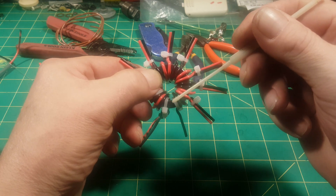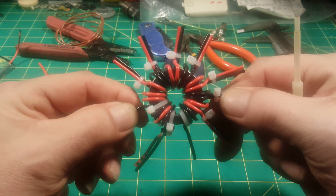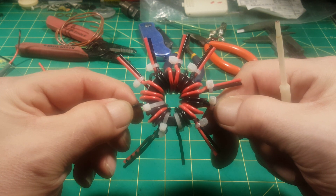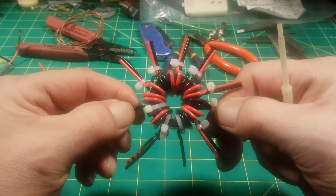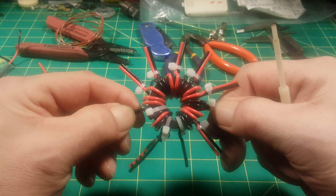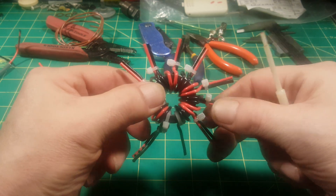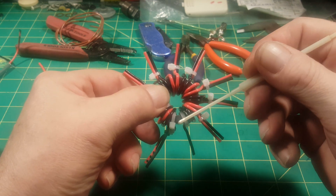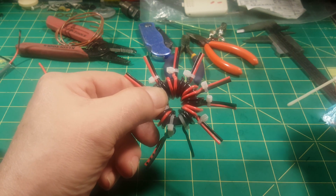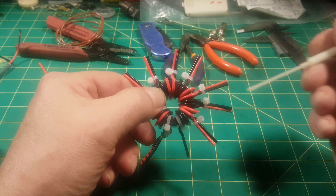You can see a gap there between the high-ratio 81-to-1 tap and the ground bundle — that's a fair gap, about an eighth of an inch. That eighth-of-an-inch gap, combined with the insulation of the ground bundle and that 81-to-1 tap, the combination should be enough. I might even put a little bit of polystyrene model cement between the two — polystyrene is a shockingly good insulator, used as Q-dope on coils. Or silicone RTV, also a very good insulator.